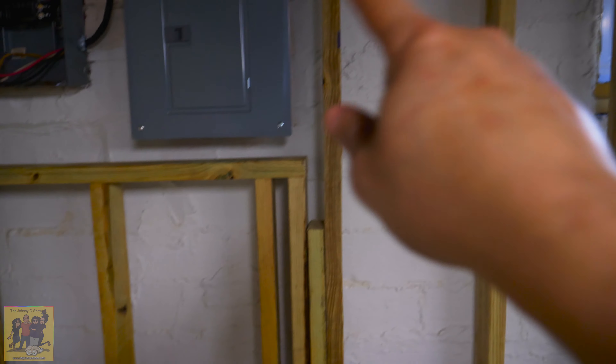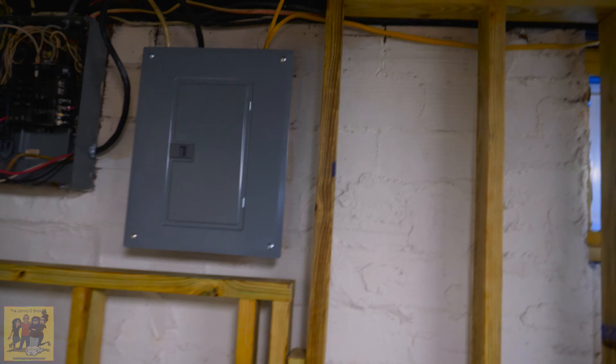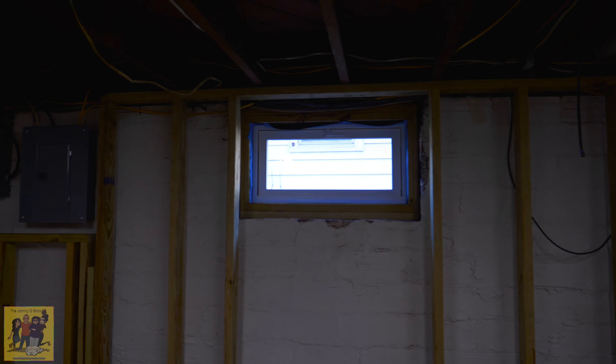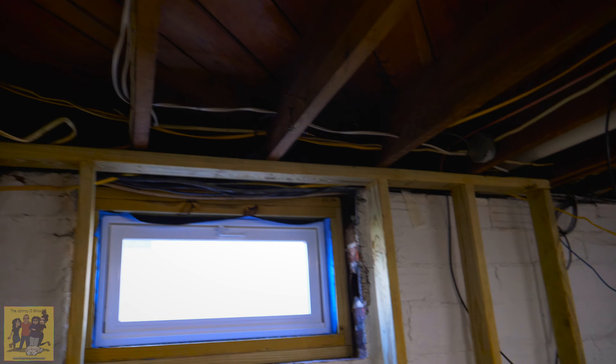We made the wall no higher than the lowest point, a little bit smaller than that. But this thing took forever to get fit in place and we still couldn't get the fit right. I ended up just throwing a two-by-four to fill the gap. This was supposed to be over a little further so we'd have room to play. We even had the sledgehammer out. Even though we accounted for height variances, there's just too much variance in the concrete floor in the house.